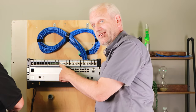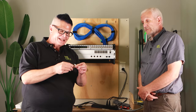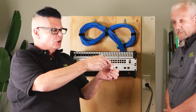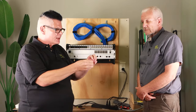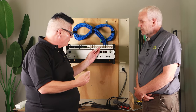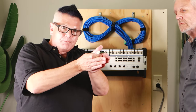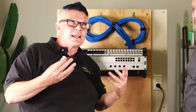The second AV keystone is a BNC connector — also coaxial cable. What's interesting to show here is this blank insert. What's standard about standard versus high-density keystones has to do with this right here: you've got the fulcrum point at the bottom, the clip at the top, the dimension across and vertically, and the distance between the fulcrum and the clip. That is what is standard. The actual rear of the jack — if it's slimmer, that constitutes high density; if it gets bigger at the rear, that's more in the standard category. But the rest of the design can be decided by the manufacturer.